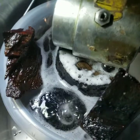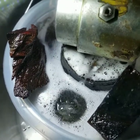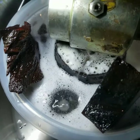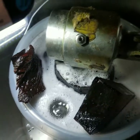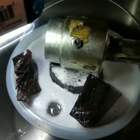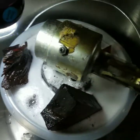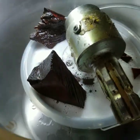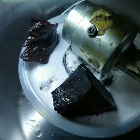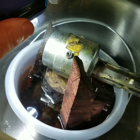We're up at a full vacuum, still getting some bubbles coming out of that cedar I put in there. This piece of cedar is sticking out at least two inches from the cactus juice and it's sucking that through the cedar and bubbling out the top. This is a third cycle. You can see it's actually fizzing up through the wood again — getting another good dose of air out of the wood, which pretty much is going to translate to resin in the wood.